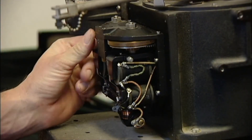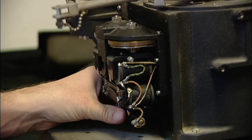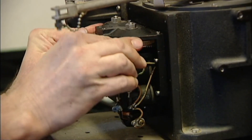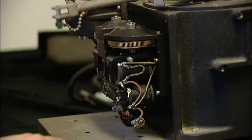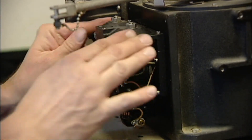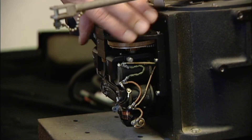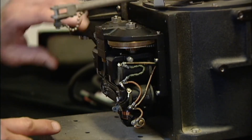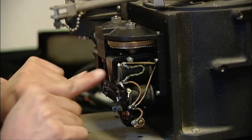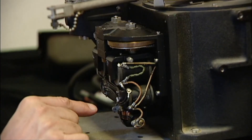On the back of the C1 stabilizer here, you have your servo or torque motor. This motor is always spinning, and these gears here are always rotating in this direction. The purpose of this is to keep the gyro vertical to eliminate the natural precession that it has. As the contacts on the side of the gyro provide voltage, one clutch or the other engages, and that causes the entire ring gear assembly to rotate.